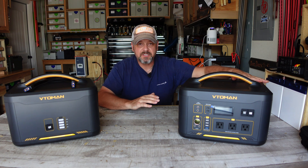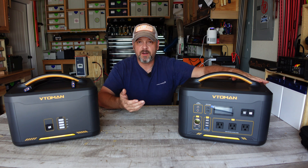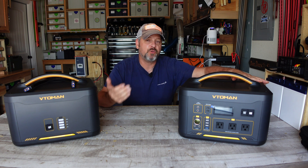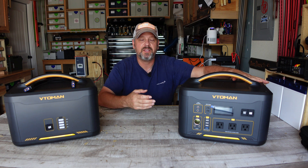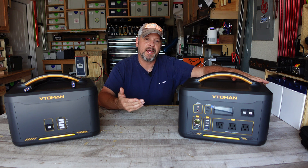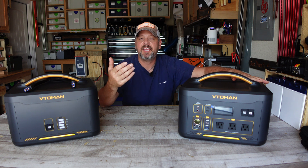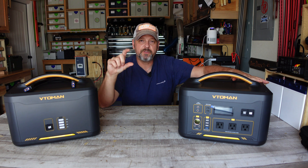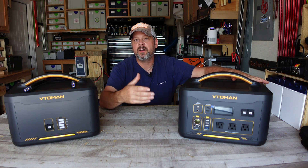This Jump 1000 is a 1,408 watt-hour lithium iron phosphate battery station. It features a 1,000-watt inverter capable of up to 2,000 watts, but there's a caveat — it's very similar to the X-Boost on an EcoFlow. If you have an appliance that draws more than 1,000 watts, say a heat gun at 1,500 watts, this battery station will lower the voltage and continuously run that appliance at 1,000 watts. Therefore it does not cut off the heat gun.